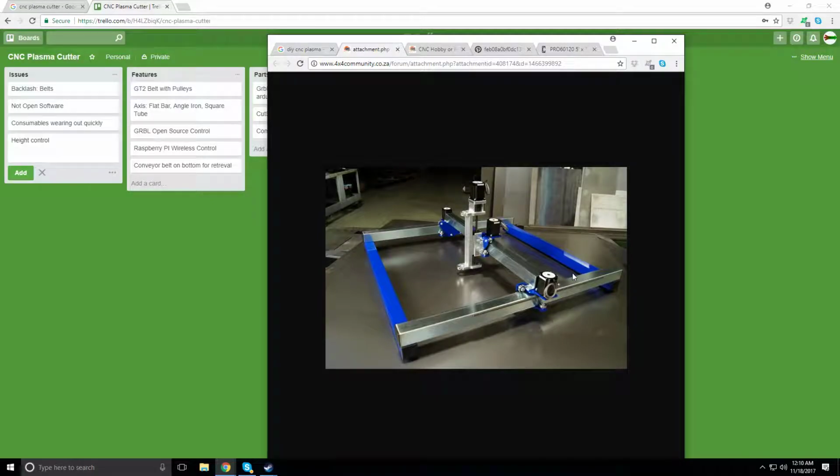And then again on here you see how the bearings are contacted, but a main thing that I have to think about is what the slats or the ribs are going to look like, and where they're going to attach, and where's the cheapest and most efficient way to have the steel attached to it. One of the ways I was thinking is to cut into this guy and have the slats go directly in the square tubing. But the problem with that is that you're basically lowering the rigidity of that piece.